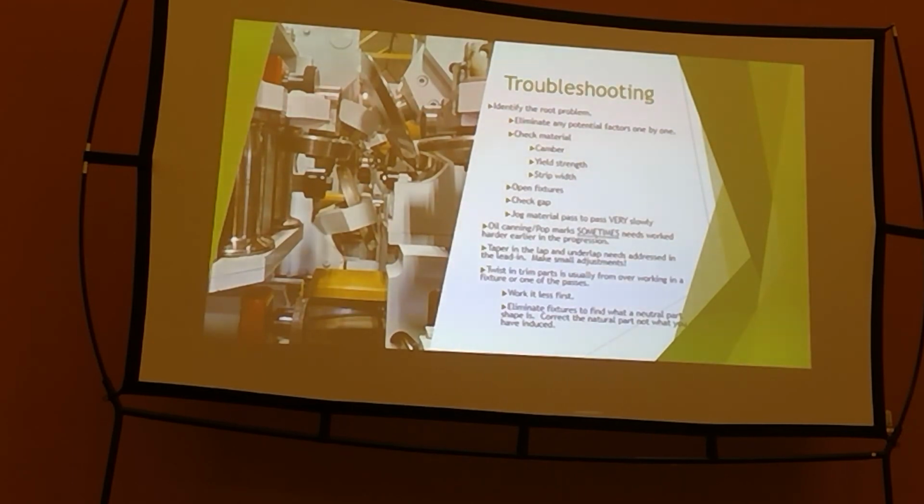In trim coil, that slit edge, it's the drop off of something else. There are so many times that slitter's not set up right, and you get a wavy edge on one side, which is longer than the other side. If you measured it very accurately, it's stretched. If you run that wavy edge on your little narrow blank going through your J trim, that J's gonna twist. It's gonna look terrible. It's gonna come out of the sweep, and we're gonna try to fix it with this fixture. But it was all because you had a wavy edge on the material coming in.